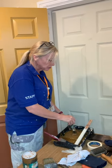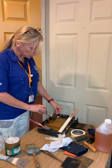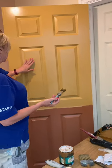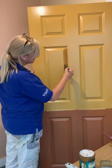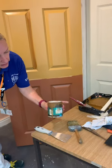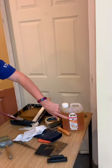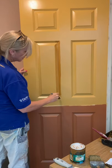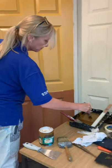In this video, I'm going to show you how to create oak. This is fake oak, but it looks quite effective when it's done. We're going to start here with a panel. With this scumble, it's already mixed up — it comes in the tin like this, mixed up to light oak. I've added a little bit of linseed oil to extend the open time, which will give us more time with the effect. We don't want it to start setting as soon as we've put it on.